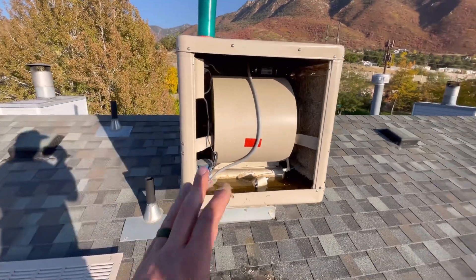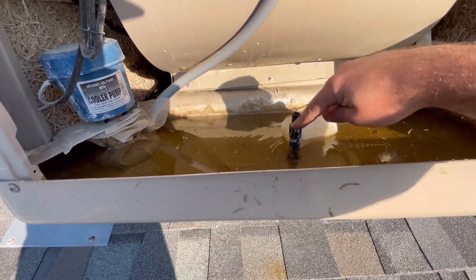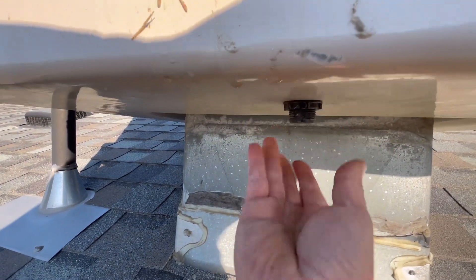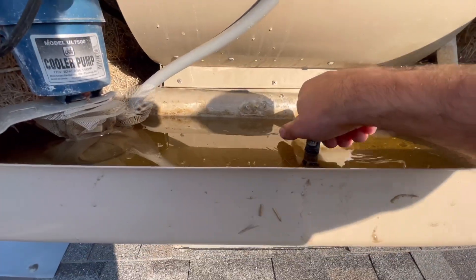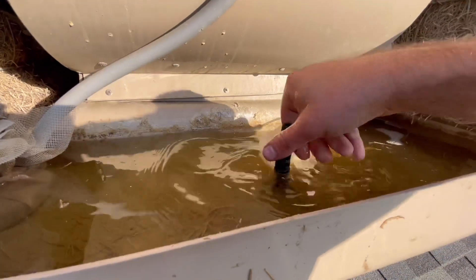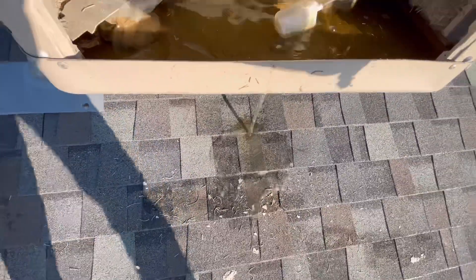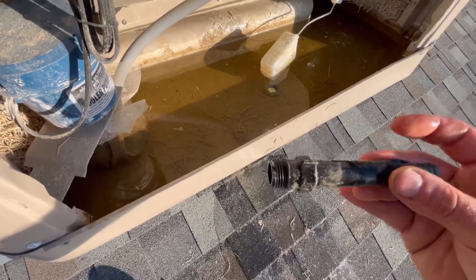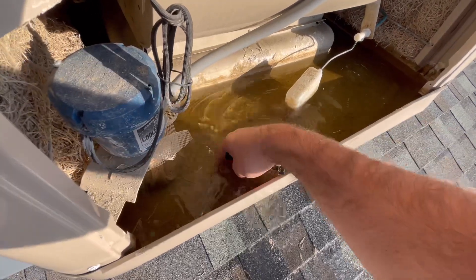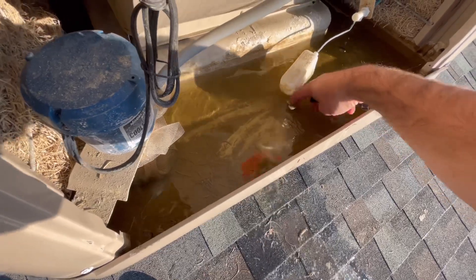In this video I'm going to show you how to properly winterize these units. The first thing that I always do is remove this to drain the water. Previously I would actually take this whole thing off, but it's kind of a waste of time. All you really have to do — this float is right in the way — just grab this middle piece, rotate it, and then it will drain out. Then come next year all you have to do is thread this back in. You don't have to mess with that at all. That's one thing I've learned over the past four or five years of doing swamp coolers.